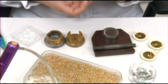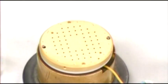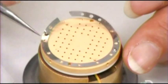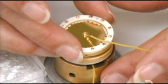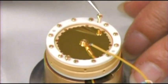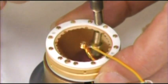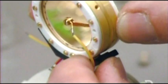Next, she'll join two capsules to create the unit that's the heart of the microphone. It converts sound into an electrical signal. An aluminum spacer goes between the capsules, which face back-to-back. Two capsules instead of one means this microphone can be switched to pick up audio from various directions. A plastic bracket reinforces the assembly.